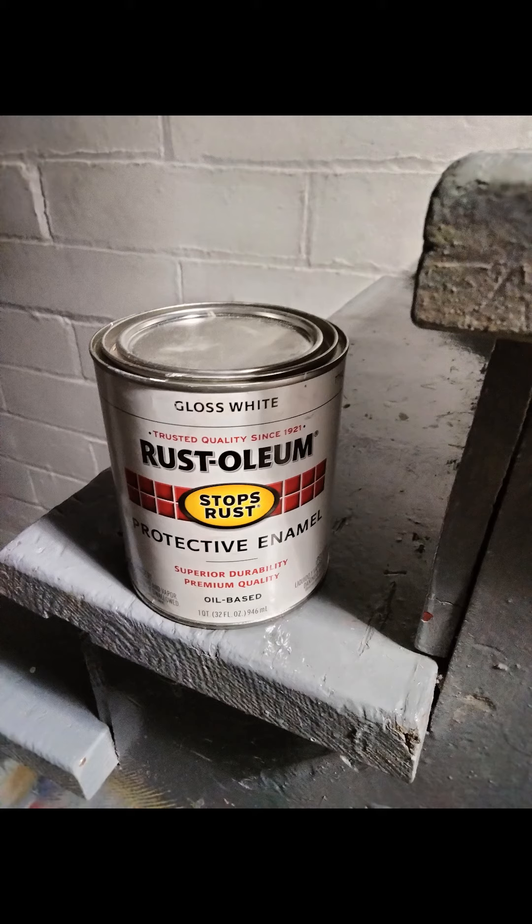I don't plan on using any oil-based paints on interior walls, because interior walls rarely get wet, and the water repellency of oil-based paints can prevent successive coatings of water-based paints from adhering without special primers.